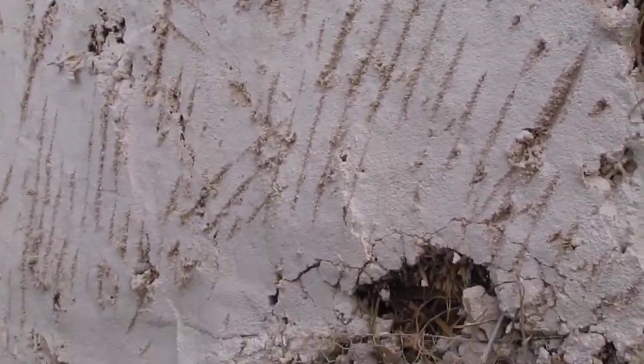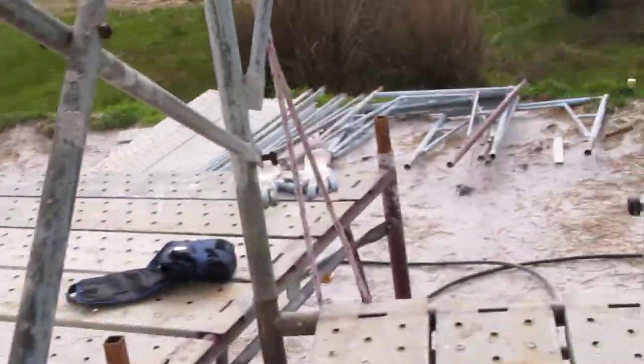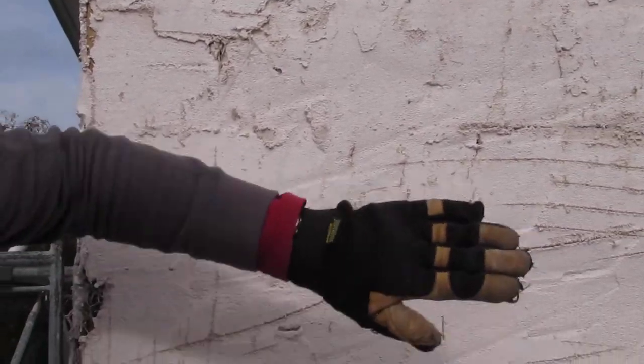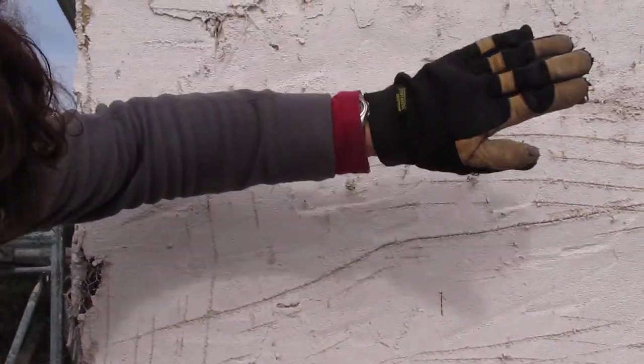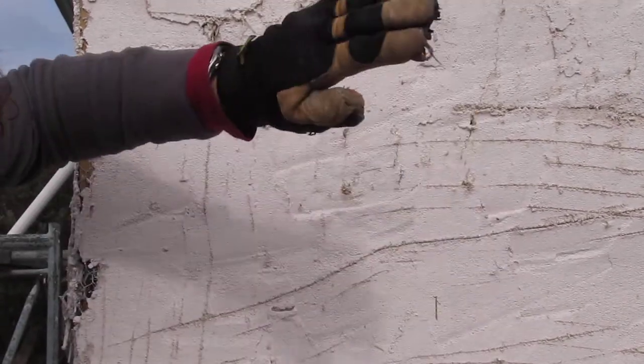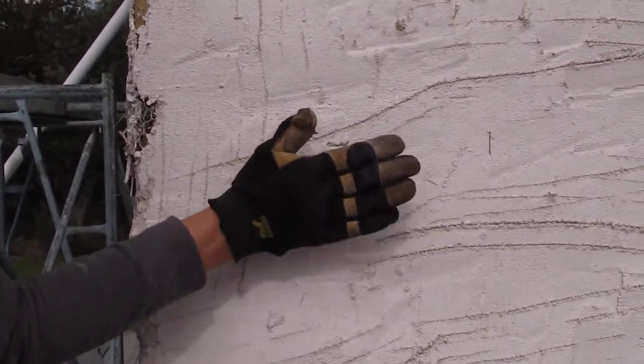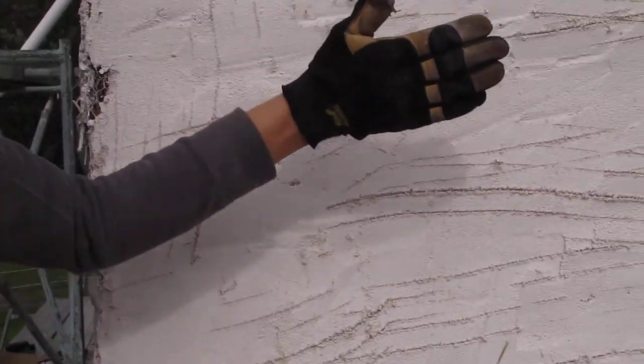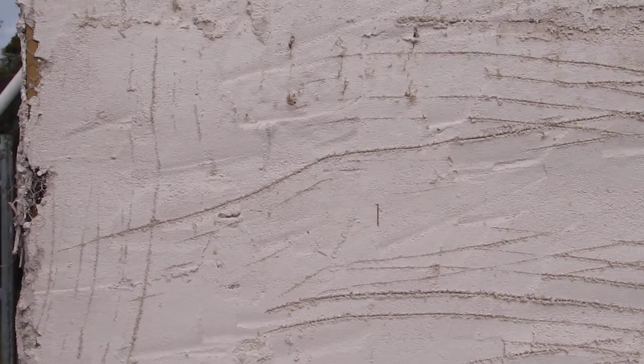I'm just going to move around the corner. Now, this is our plaster — this is our first coat. Like that spray renderer had her first coat. Nothing is cracking or falling off, and it actually quite hurts my hand to do that — I'm exchanging hands here. So it's not going to come off as you can see. That's how it should behave.